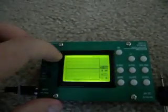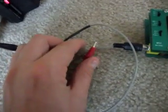As you can see, our oscilloscope is flat-lined right now. I'm going to put the scale onto 0.1V per box in the vertical direction. I've grounded one probe into the electrical system. The other probe is free and that's what we're going to use to measure the body voltage.